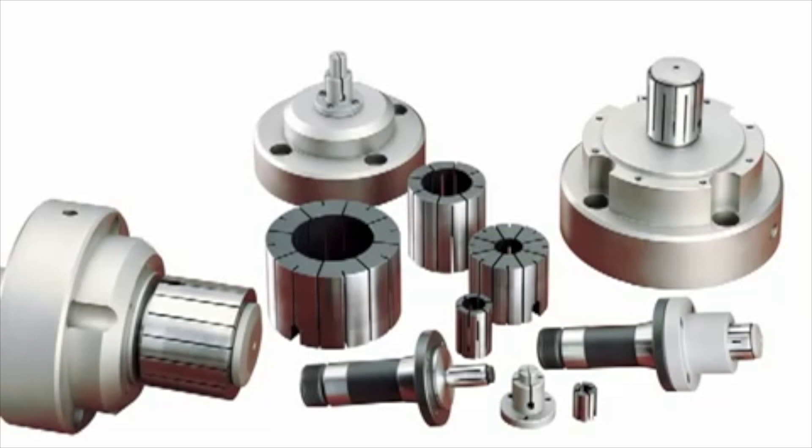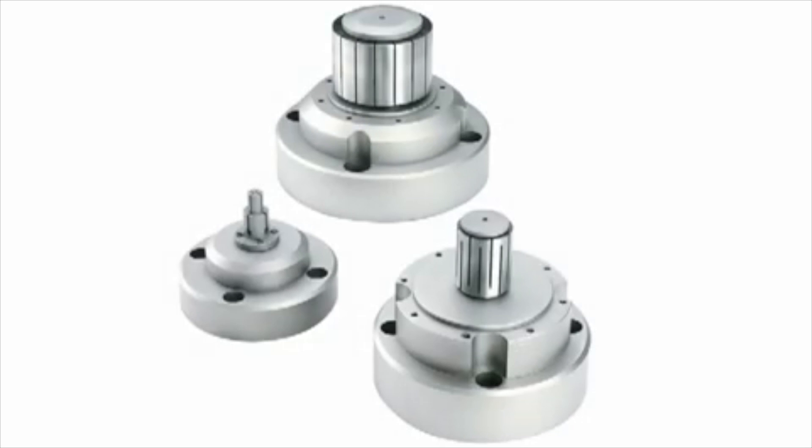Models are available for all brands of machines to grip internal diameters from 1 1/8 inch up to 4 inches. The spindle mount style mounts directly on certain ANSI and ISO A2 spindles. A drawbar adapter is required to actuate the collet.